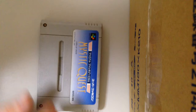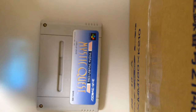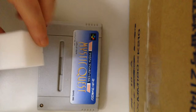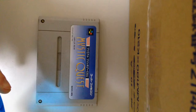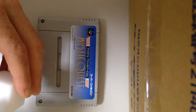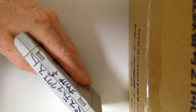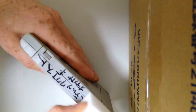I actually use alcohol — 54% alcohol — to clean the marker. I apply a little bit to the sponge and a little bit to the cotton buds when I clean the contacts. For me it's fine, it does everything. It's not corrosive, so it won't corrode the copper tracing on the PCBs. So I just want to show you an unedited one. This is the marker, and this is the melamine sponge with a little bit of alcohol on it. It literally won't take very long to get this off.